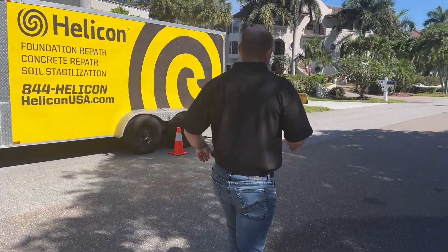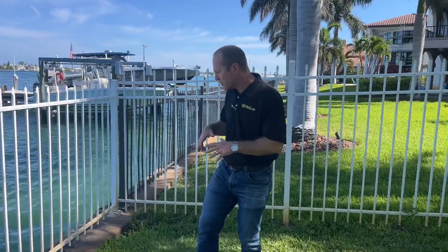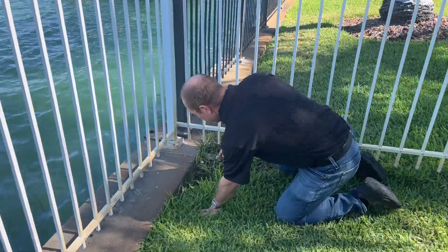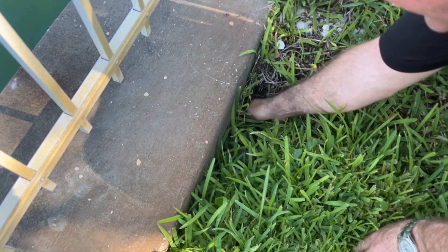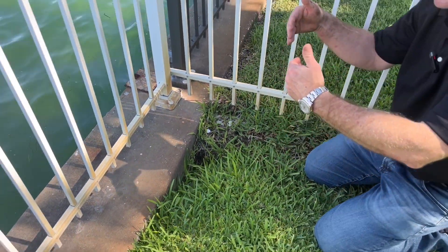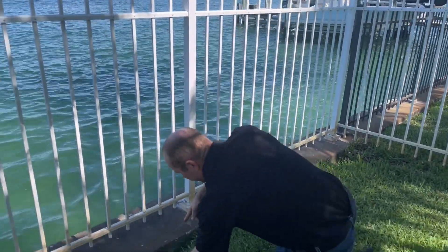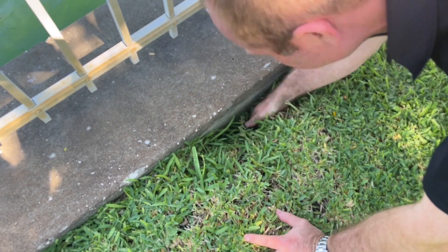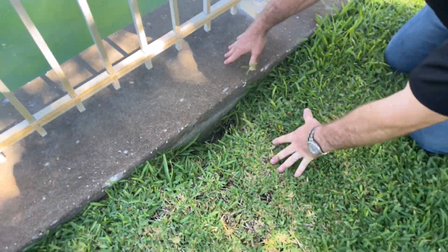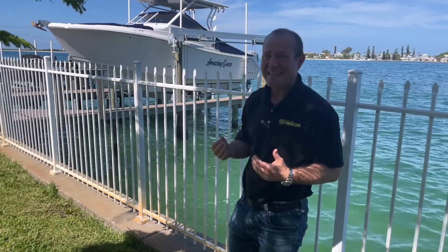Let's check out some of the signs. Starting at the front corner of the seawall is normally where you see signs of erosion. You can see the soil starting to give way — I can fit my hand down in here pretty easily. The soil is eroding out through cracks and crevices in the seawall. The black filter fabric installed during construction has disintegrated or developed breaks, so it's no longer retaining the soil, creating voids. I can stick my hand in and touch the front part of the seawall — there's just a void of space.